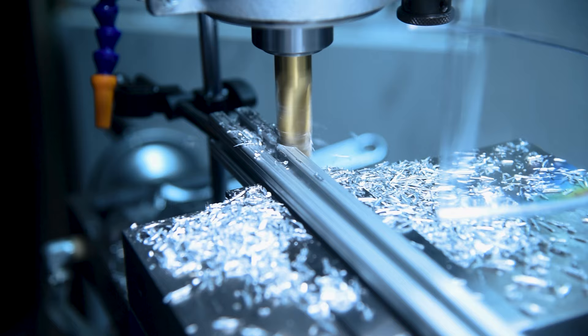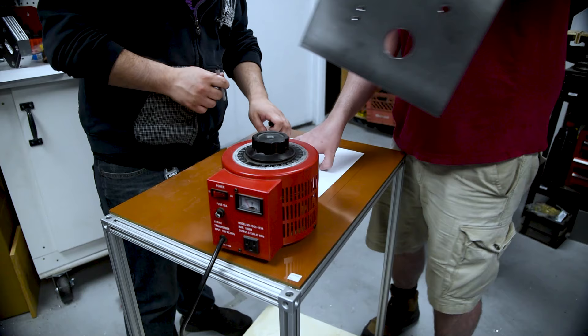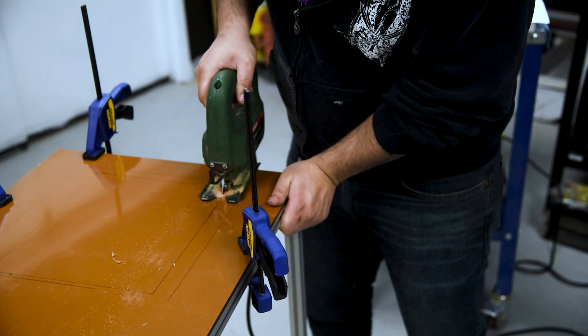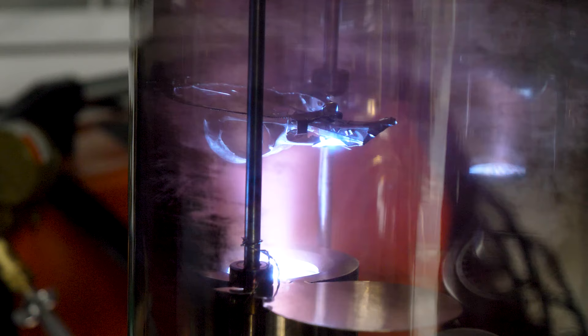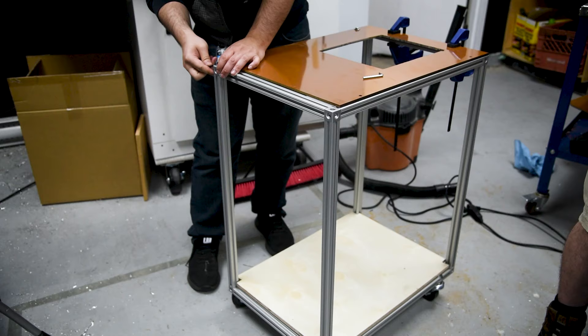For example, when we wanted to add some wheels to it, it was a very quick mill job to cut some holes and channels to fit the nuts, bolts, and wheels. The top of the cart was made of a material called Garolite — a fiberglass epoxy laminate that is extremely insulating but also very strong. This way, the main parts of the machine can rest suspended on the Garolite and not make any electrical contact with the aluminum frame, so if some very high voltage was connected to something incorrect by accident, it wouldn't electrify the frame and be a massive safety hazard.